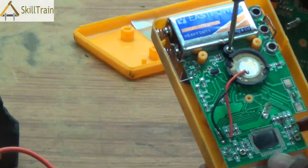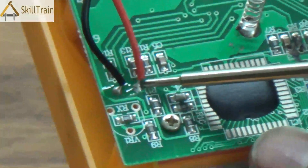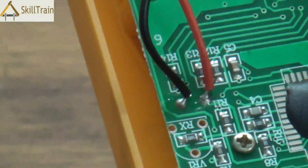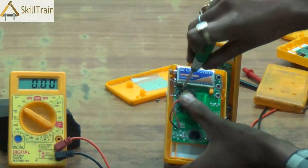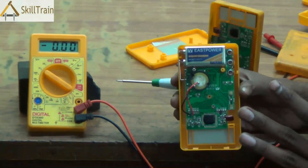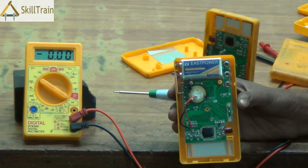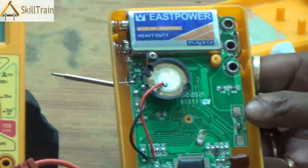To replace the buzzer, you will see a small screw holding it — use an aligner to open that screw, which will remove the buzzer from the PCB. Once removed, it is soldered at two points. Use a soldering iron to remove the old buzzer and solder in the new one. Ensure the positive and negative terminals of the new buzzer are placed in the correct positions. Once placed, tighten it back. Please exercise extreme care and don't touch anything else, as it is a very sensitive device.